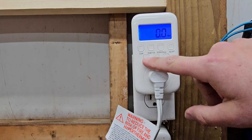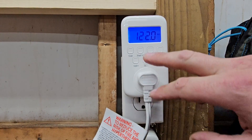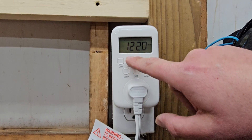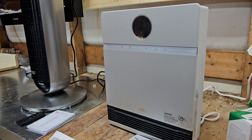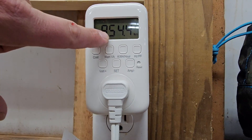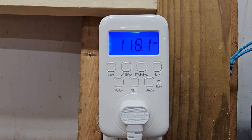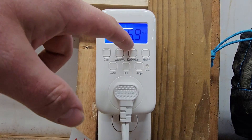Let's go ahead and put it on watts. Let me show you the voltage first — when we're not using any electricity, you're going to see the voltage stay steady. Watch what happens when we start using electricity. We're going to keep it on wattage — notice it was 122 volts. I'm going to take my remote controller for my smart wall-mounted heater and turn the power on. Our wattage is climbing because we're starting to use this space heater — it's almost 1000 watts and probably going to be over 1000 in a moment. Look at our voltage: 118, it was 122, it pulled down to 117. So you can see that when you're using a heater, it's affecting your voltage.